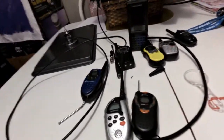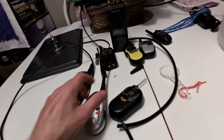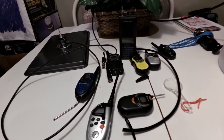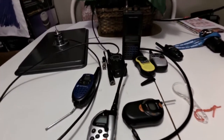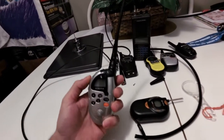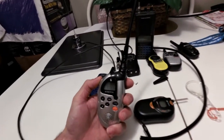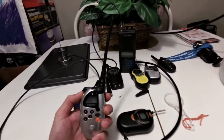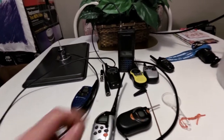If you want to stick to 100% legal, just extend the length of the antenna to six inches and it will help. There you go — legal ways to extend your FRS radios. Height is your friend when mounting your antenna. If using an FRS radio indoors, get it in the window or to the highest point in your house, or get outside. The worst place to be is obviously in a basement. The higher up you are, the better your range for transmit and receive. I hope that helps.